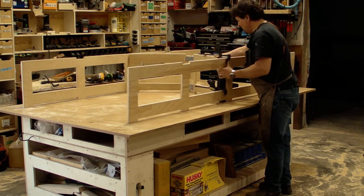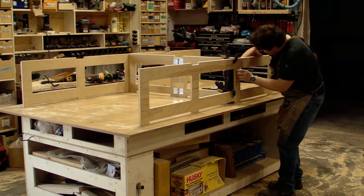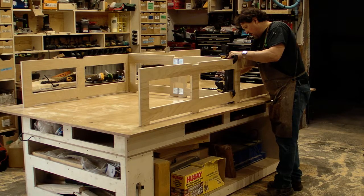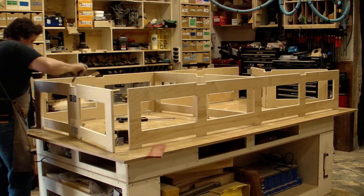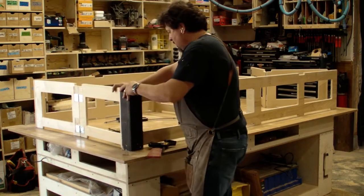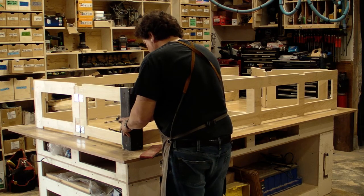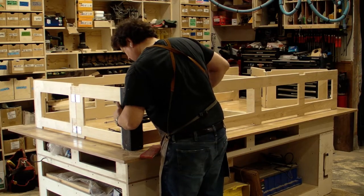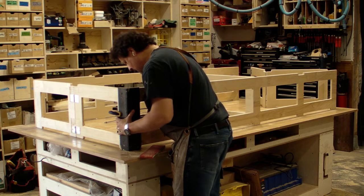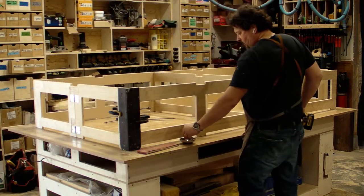I'm moving on to the other side. I put the block in exactly the same way I did before — clamp it in place, flip it up, and put the screws in. Doing these corners is a little easier. I only use two clamps. I line up the whaler in the corner on the side piece, make sure it's clamped in. Once it's clamped in and lined up, I ensure the tops are lined up — even on a flat bench, and mine is pretty darn flat. Make sure they're butted up nicely. Then I take a drill and put in another six screws, and I do that four times.